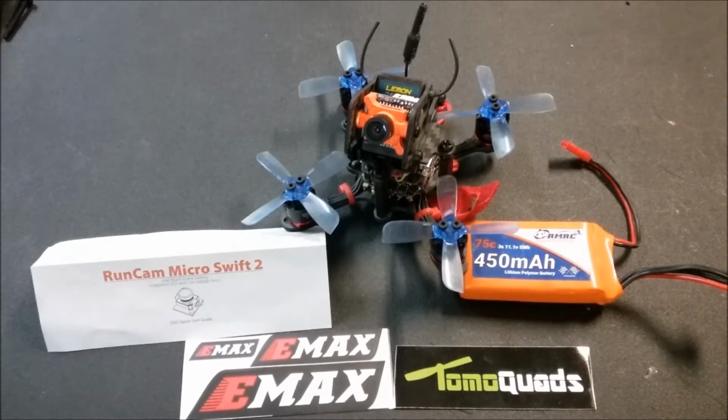The soldering is not that bad. I'm using the Fly Tower F425 in this because I had a bunch of those. It's a great little tower, but there's all kinds of cubes out there. Fly Tower has a couple different cubes too if you wanted to do a 2S or a 3S build, and with a 425, you can even go to a 4S build if you wanted to. And Emax has got some motors now, the 1106 RS series, that are 4S capable. It goes to a 4500 kV. So that's something to consider also.